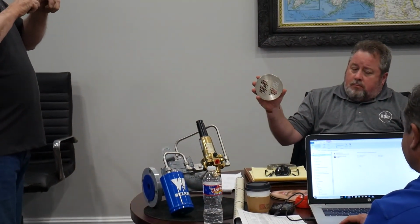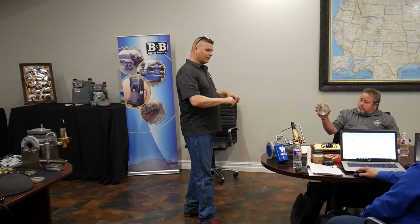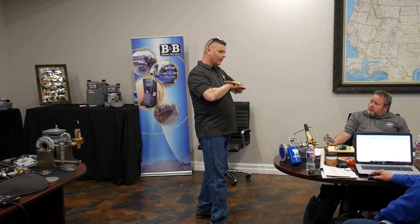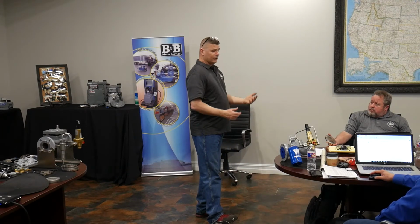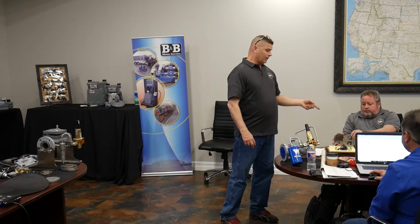Also, it moves the area of high velocity of the gas as it's flowing through across the plate down into the nozzles. So now my area of highest friction between the soft goods and that stainless steel plate is not right at the surface of the plate. It's down in the nozzle, so I get less wear on my soft goods. So it gives you benefit of both. So it's a great investment. They do cost more, but so does a slotted reduced capacity plate, because all of that welding in the restrictions you pay for. I'm talking about the customer pays for. So it's an increased price.